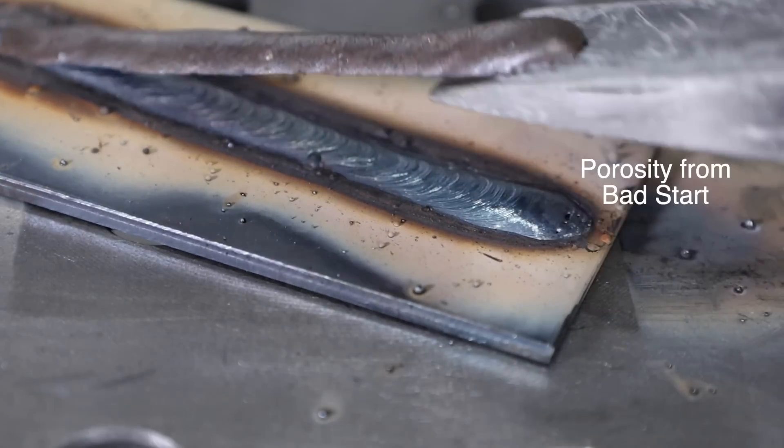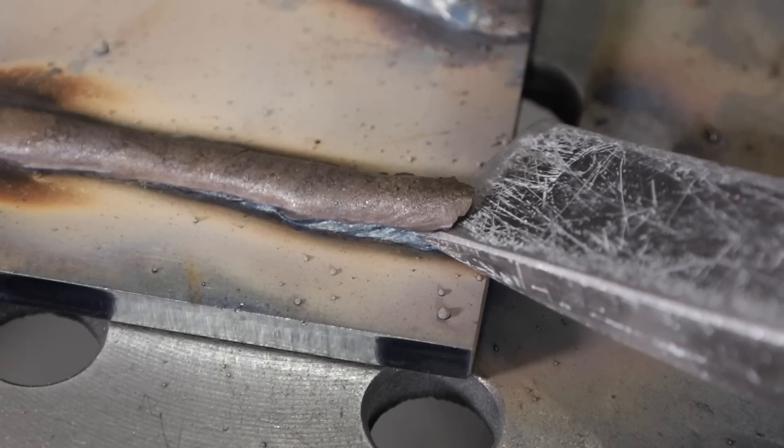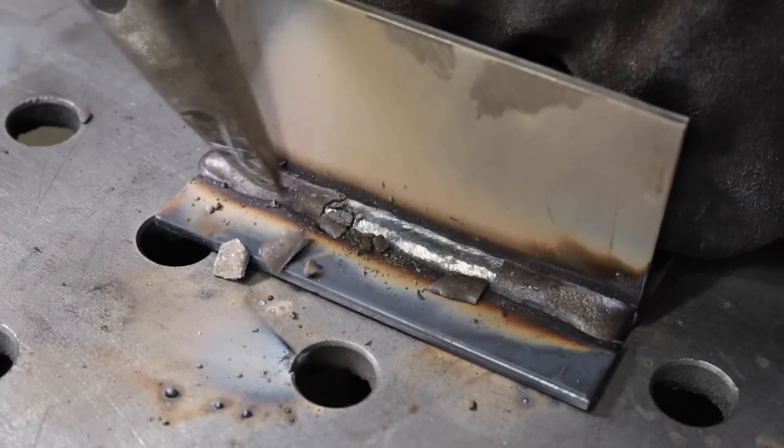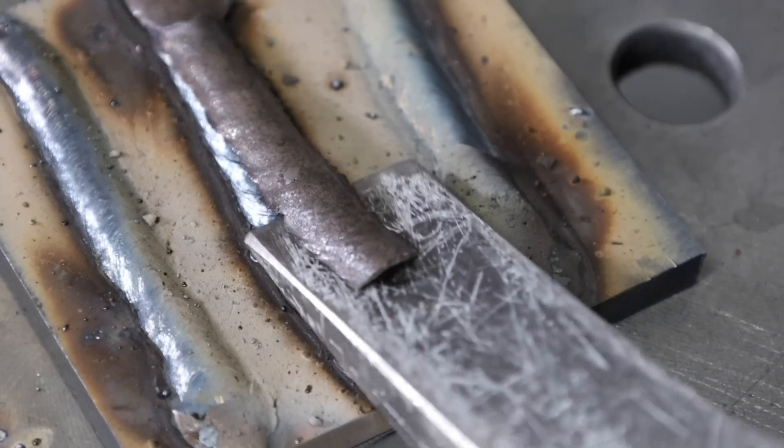It's really easier than other electrodes to see where your weld pool is and read the puddle, because the slag will sit back behind your puddle. I did a whole video about watching what you're doing and reading the puddle, so if you're having trouble with that, check that out in the description. Another nice thing about this electrode is that after you finish welding, the slag — while a little heavier than other rods — comes off in big chunks, so you can be confident you've got it all off before running any other passes.